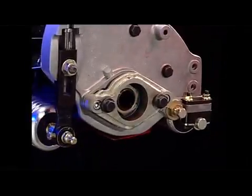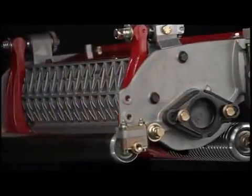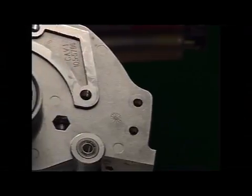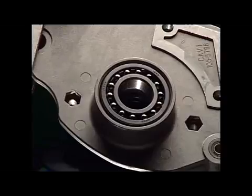The DPA cutters have earned a field reputation of superior adjustment retention even in severe applications. There's no worry for the technician that cutters will mismatch during the mowing cycle. Bearing housings are cast into the frame, holding the reel and rollers in parallel alignment. Tough sealed bearings are used throughout, so no greasing is ever required.